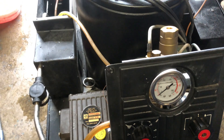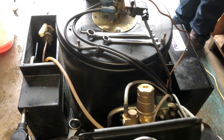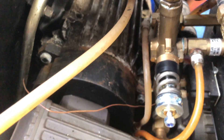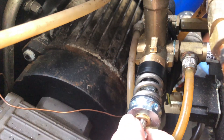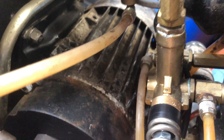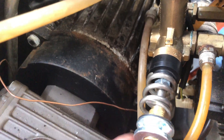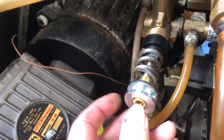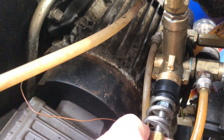So we'll turn this machine on to cold and on to hot - what we want to do is get this machine working on hot as well, so we've got heat expansion to set the safety valve. This is the blow-off valve. As we look at this unloader here and the safety valve - there's your safety valve and this is your unloading valve here. Now the unloading adjusting valve - I've taken the grub screw out of the system.